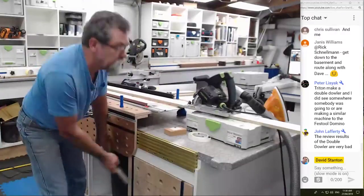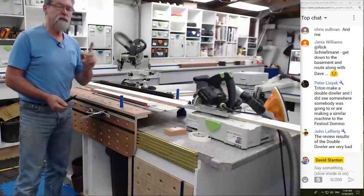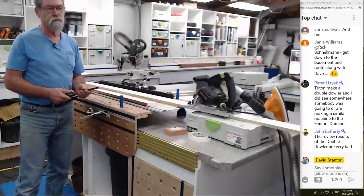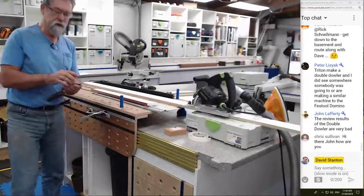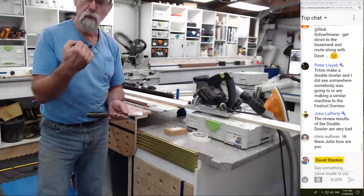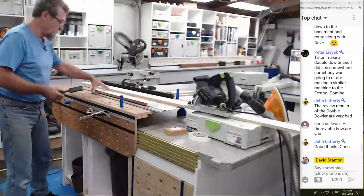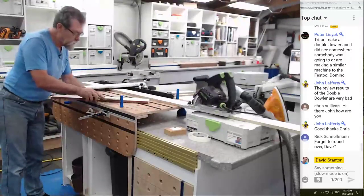I've been using both systems. I've been using the Sorby Pro Edge and the Triton, and they're both fantastic. If I was a wood turner, definitely the Pro Edge. If I was just a guy in a shed with chisels and planes, I'd get the Triton. Derek has made comment that he's not overly convinced with a hollow grind because it doesn't leave as much meat on the cutting edge to reinforce it, whereas the Sorby Pro Edge does leave more behind it. So maybe that makes it stronger. He's got both types as well, so it's not as though he's talking off his hat.